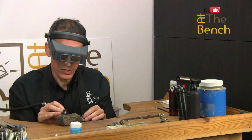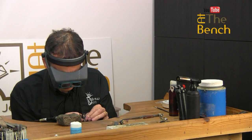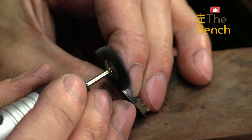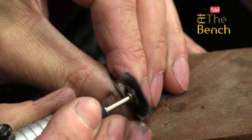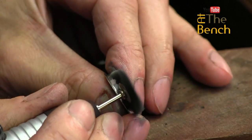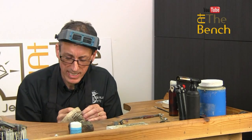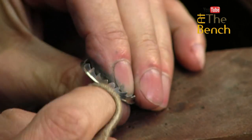And we are simply using this brush, replenishing that polish quite often initially. The more polish you have on here, the more aggressive it is. And then as you're coming around and you think, do you know what, that's looking pretty good, keep the speed high, ease off on the polish. And as you can see, literally within a minute and a half, I have produced a beautiful, beautiful finish, exactly where people have been finding it really, really hard to get that 90-degree area nice and clean.